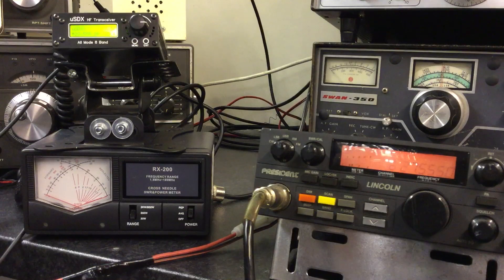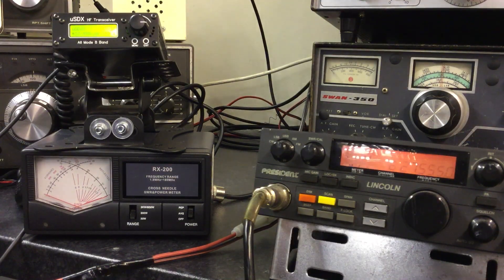I'm sure that if you adjusted all your settings for 11 meters on the Micro SDX / Micro SDR, it would sound great. I've had nothing but good reports on 80 and 40 meters since I adjusted my settings properly for those bands, and I have no reason to believe it won't be just as good up on 28 and 24 MHz. The power reportedly drops off the higher you go up the band - that's just the nature of the beast, all part of the experimentation.